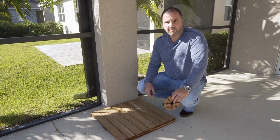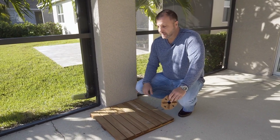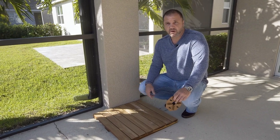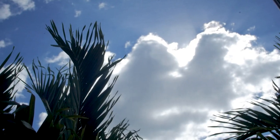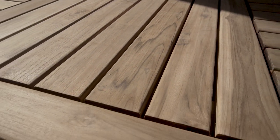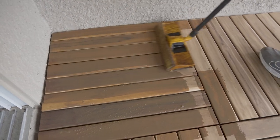After that we're going to put on the Wisecoat water-based oil finish on top, which will keep that nice teak color — in fact it makes it look a little more golden brown. This area will probably take about a half hour to apply that coating; it goes down very quickly. We'll probably do that about once a year depending on how much UV the area gets. It's like oiling a cutting board — not like painting a wall — you just slop it on with a paint roller.